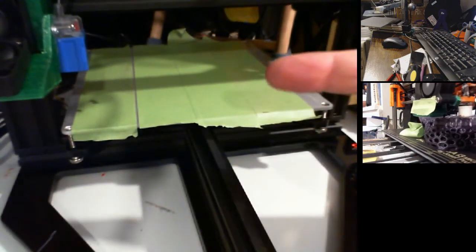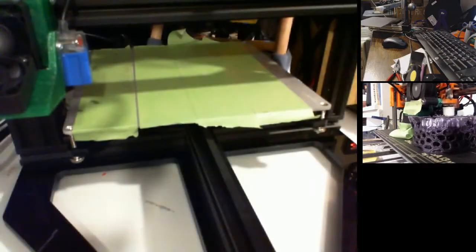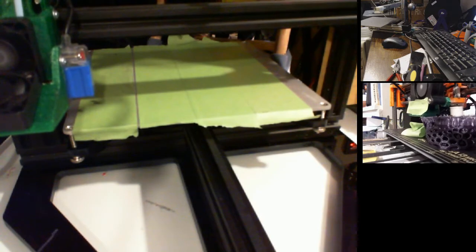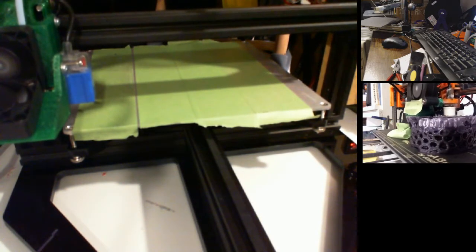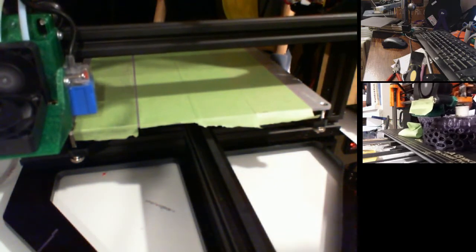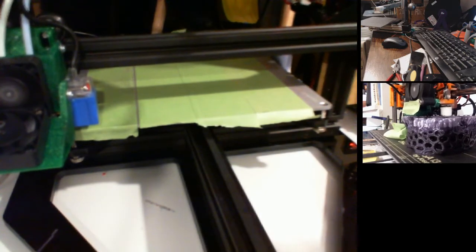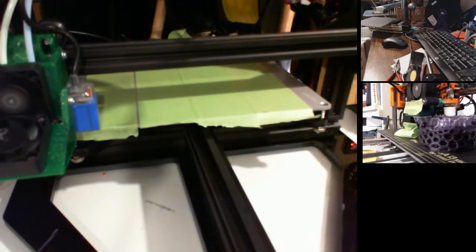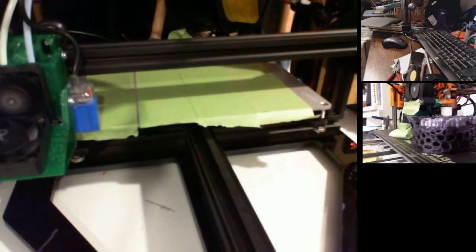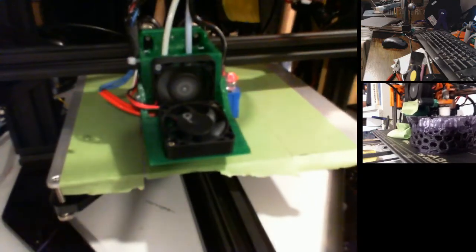So if you watch, see how fast the Z is homing? That's not controlled by the acceleration, but now that I have this whole chart of Repetier codes, they list Z-axis homing feed rate as one of the things that I can change, and I think I will. Because really that is way too slow. Alright, so we're going.